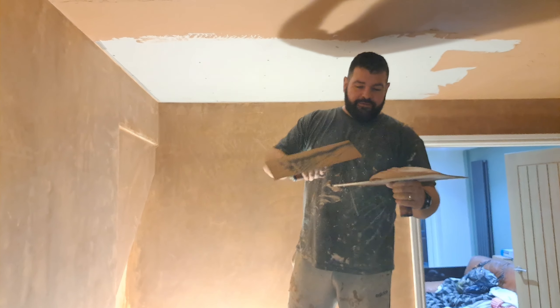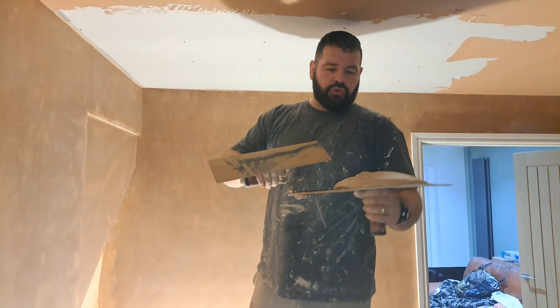The first thing I want to show you is how to plaster into an angle — into the corner between two adjacent walls, or a wall and a ceiling — without getting the opposite angle covered in plaster. It's something I see a lot of beginners do, and I did myself. You make a mess of the other wall because when you come across the angle the plaster squidges out and goes all over everything.